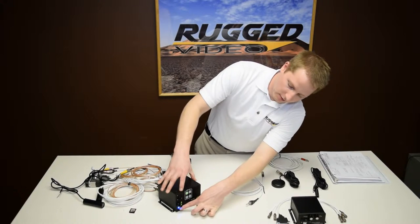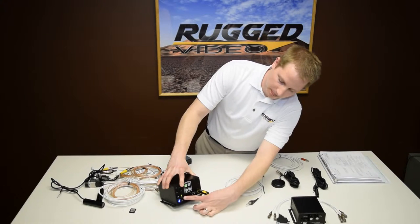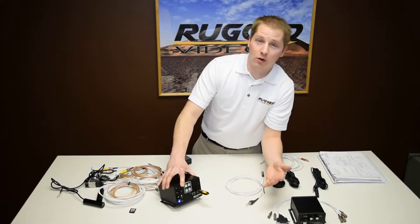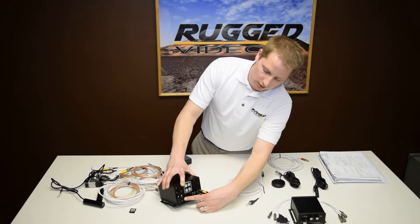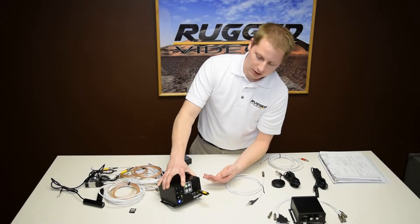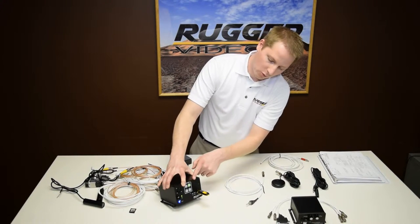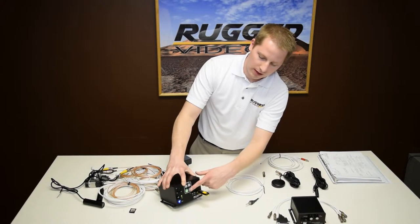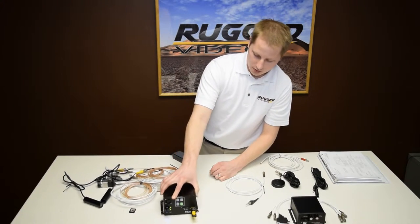You see here you have a blue GPS light, a red fault light which isn't lit up, a record light, and a standby light. The GPS is blinking meaning we don't have a GPS signal — we'll plug in the GPS in a little bit. The important thing is that there's no fault light, which means that we have valid media as well as valid video. So go ahead and switch through the cameras manually right on the front. From camera one to camera two — still no fault light so we have valid video. Camera three has valid video, and so does camera four. So we're off to a good start.